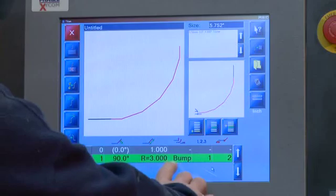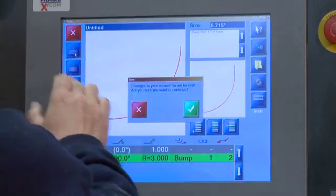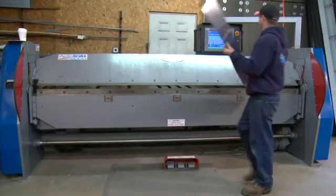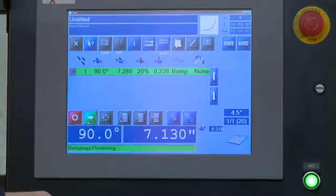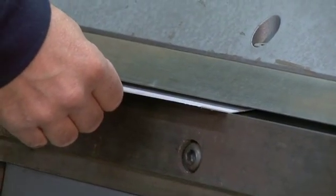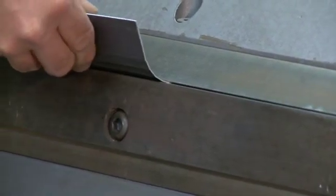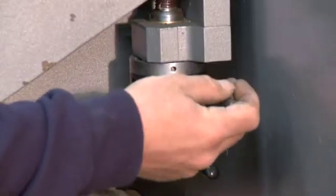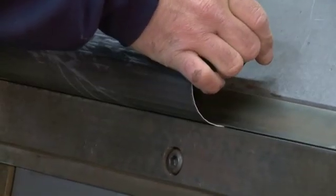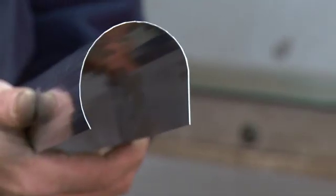As you can see, the part is drawn on screen. By producing more bends to create a 90-degree part, the smoother the part will look. Radiuses can be formed two different ways. The first way is by setting the bend leaf to a required degree of bend — the clamp will open and close automatically, and the back gauge will keep forwarding the material to the desired radius. By adjusting the lower knuckles on the left and right of the bending leaf, you can adjust for an infinite number of material thicknesses. Within a moment, a desired radius part is done.